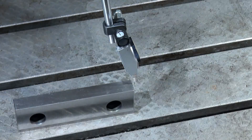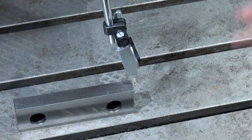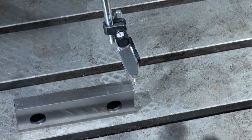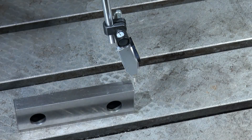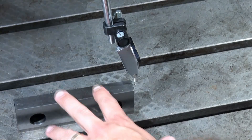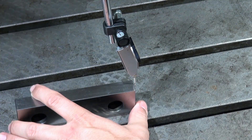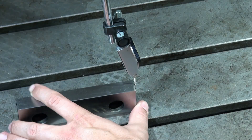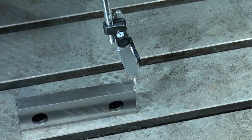We're going to measure machine backlash here in the X-axis. This technique is the same for every axis. It's a pretty simple technique. What we're going to do is we just have a gauge block, and we're going to slide that gauge block up against our dial indicator, just a little bit so that we get a reading.